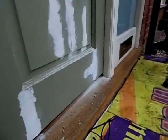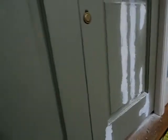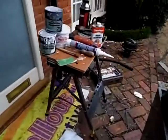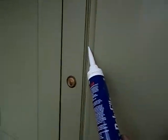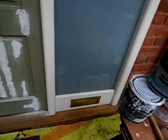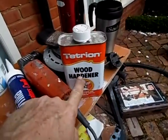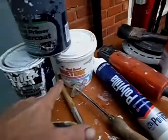It'll take a couple of spots where the joints are — same thing over there. That one's a bit worse; I think the sun gets to that one more. Then on the sides over here I'll be using polyfilla decorators filler, with a thin bead down there, just where it needs it. If the wood was wet or rotted I'd use some wood hardener first, then go to the two-part filler.